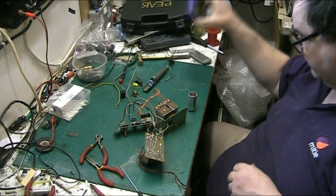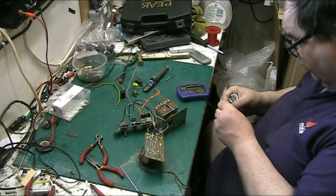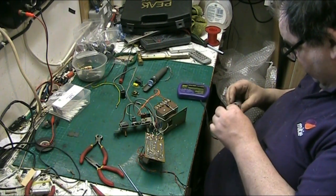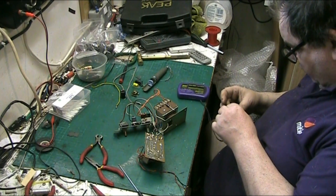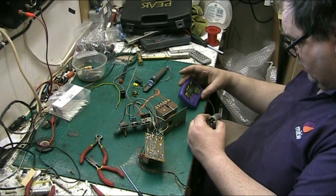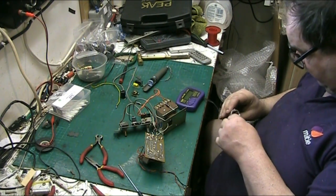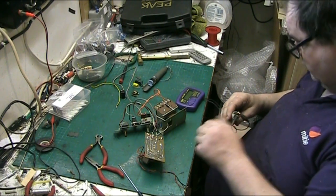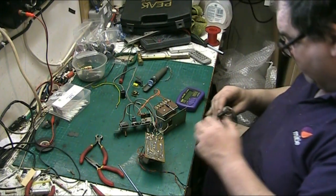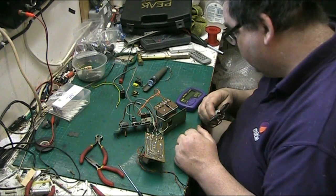Let's test this capacitor and see what it manifests. It is a Hunt's one, so I don't have any great expectations, although you never know. Doesn't matter what we clip onto, because we know what the values should be. 17.98. That's on the 16 microfarad. That's not bad. 32.69. Oh, that's pretty bang on. And let's go for the 25 volt, 25 one. Oh, no.